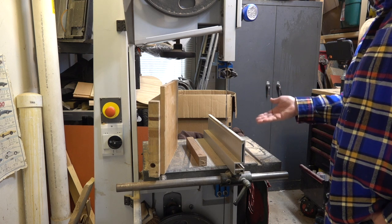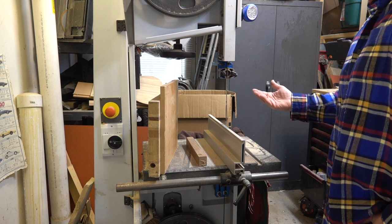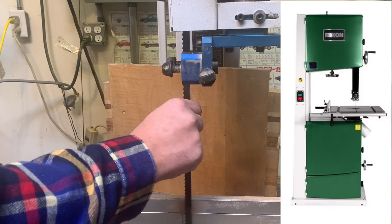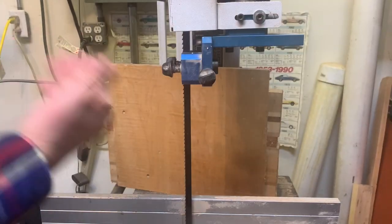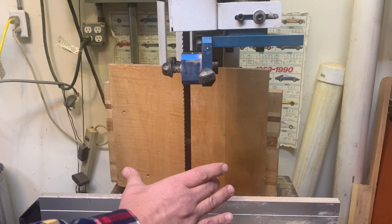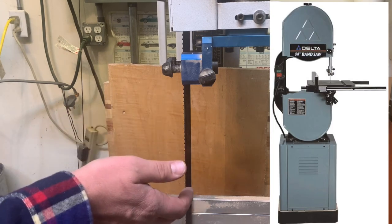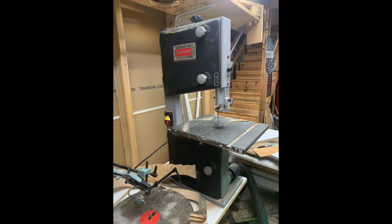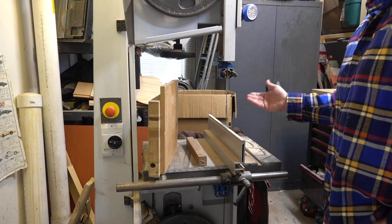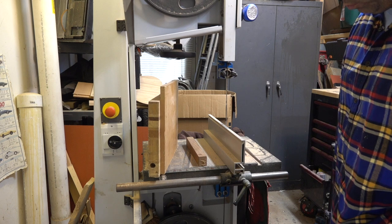For me as a luthier re-sawing lumber, this has turned out to be a great tool. I've had about five bandsaws. I had the Rikon 18 but you couldn't get a big blade on it and there was some deflection — I didn't like that machine. I also had the Makita resaw machine with a huge three-inch blade, and a Delta 14-inch. Now I run a Craftsman 10-inch downstairs and this, and I can get through anything I need. I think maybe I would have liked the Laguna 18 for a little bit more space for guitar bodies — that was probably my only mistake, not going one size up.